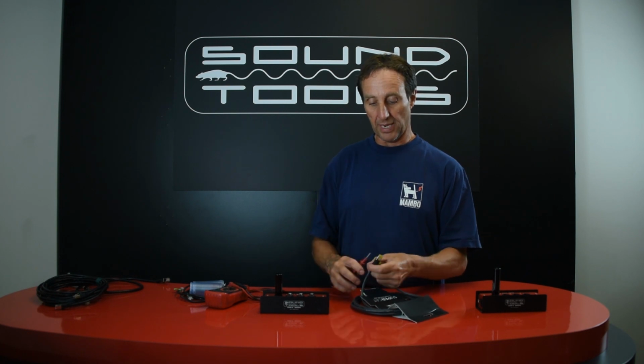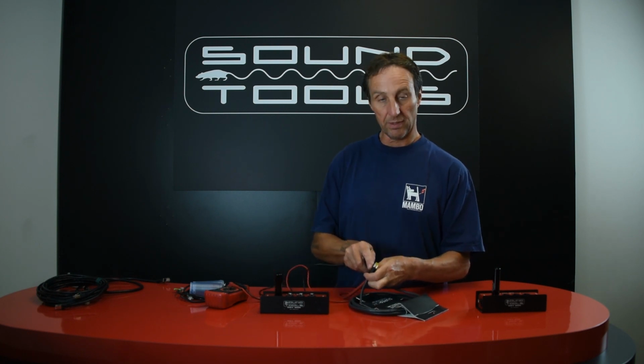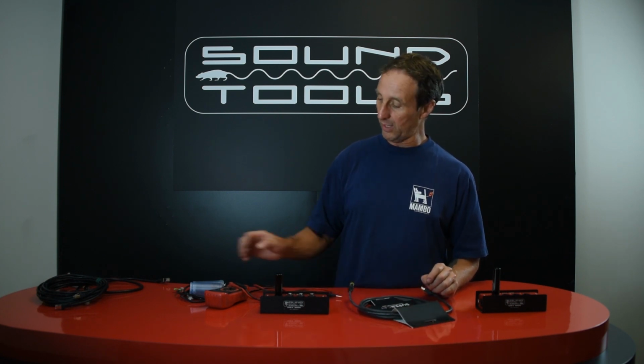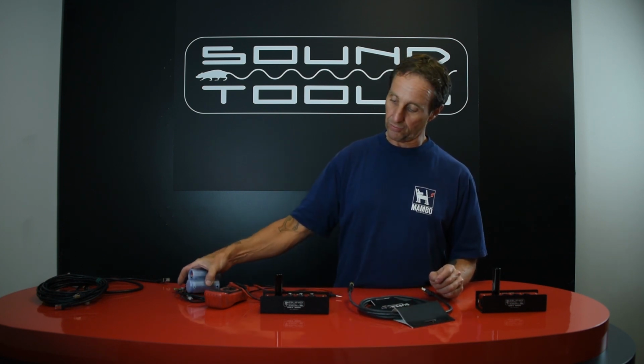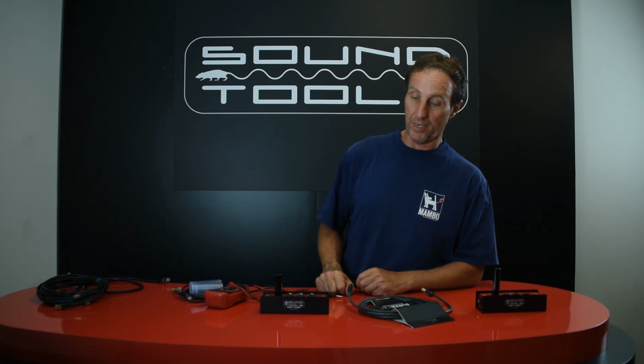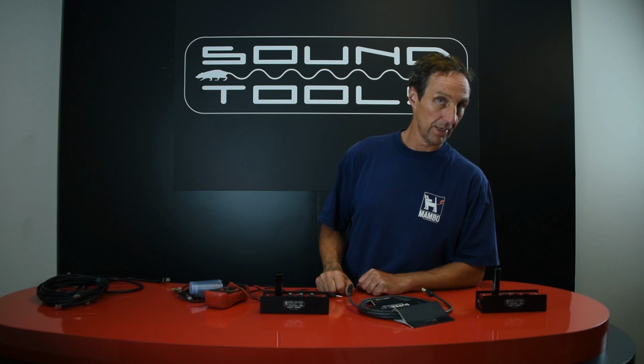So it's important that you either check with a multimeter between the housings or find a test method that checks for the shield, especially if you're having some troubles picking up phantom power or other signals down Cat5e or better cable.